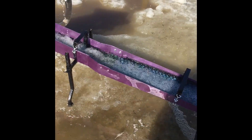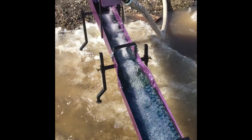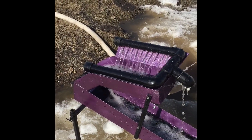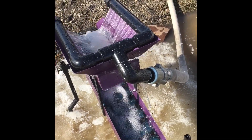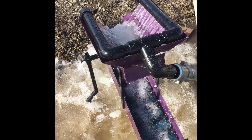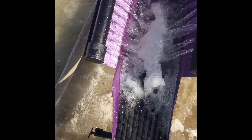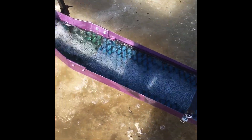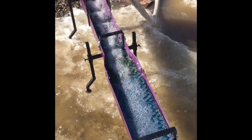There she is again. I had to put her down on the ice here — it was starting to erode the driveway. I think the only thing I'm not too happy with is all the air bubbles. I think the holes coming into the spray bars are a little bit too small, so I'm going to increase them one size. Going from an inch-and-a-half hose down to the one-inch is probably going to cause a lot of cavitation and create some oxygen and air bubbles. Once you start putting some dirt with it, it'll get a slurry built up and you won't get a bunch of air bubbles.